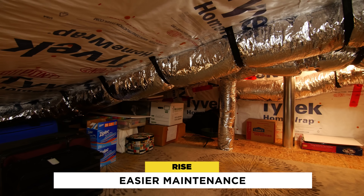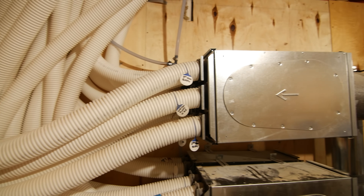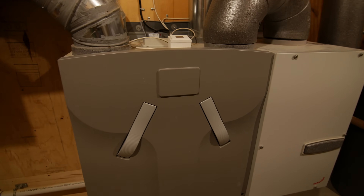The inside wall contains the fan and control panel, and the outside wall has the ventilation hood. Now there are a ton of advantages of going ductless — easier installation, easier maintenance, and less unnecessary loss of hot or cold. A typical ducting system loses 25 to 40 percent of the energy put out by your heating or cooling system. Some beefier HRVs, those rated for high-performance homes like passive homes, can achieve 80 to 90 percent efficiency, but those also come at a cost, and installation is much more involved than these ductless units.